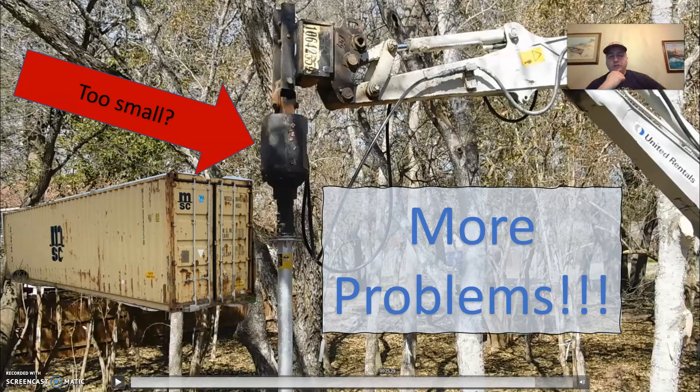But I want to figure out how to do them because there's a lot of advantages to the ground screws. You're using a lot less concrete — it's significantly better for the environment. It also has less impact on the ground. So if for some reason you wanted to pick up and move this home someday, you could take these ground screws out and you haven't permanently damaged the soil. You don't have the issue you sometimes see where a traditional house on a slab burns down and that slab remains — those properties can actually sell for less than just the raw land.